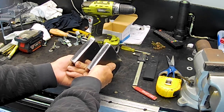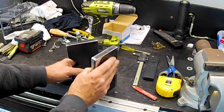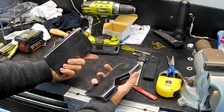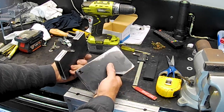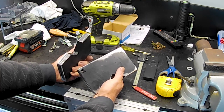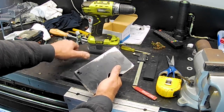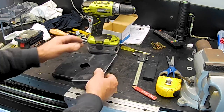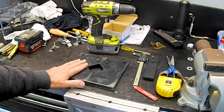But they are now nice and square, the edges, and nice and flat. It's all chamfered and deburred. Nice sort of rounded edges on everything. So at least you're not going to be catching on lumpy bits on the corners and having them rock because there's a dag on them. And they are now nice and flat, or pretty close to flat. Not perfect, but certainly good enough for a press. So all we've got to do now is paint them.